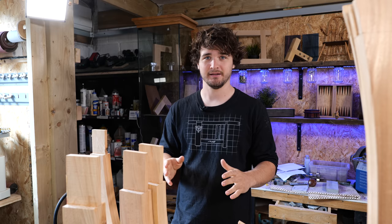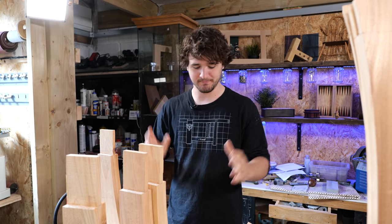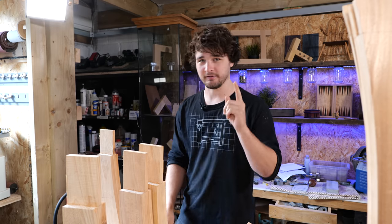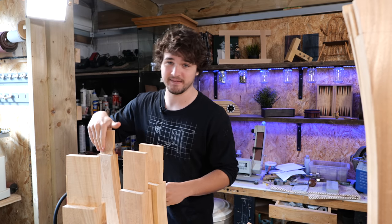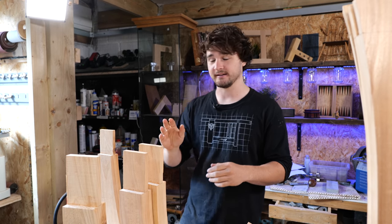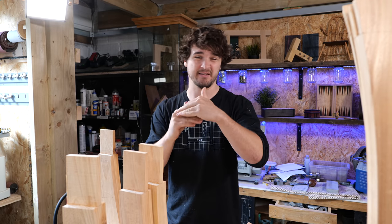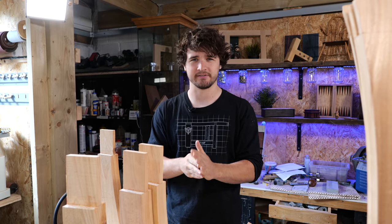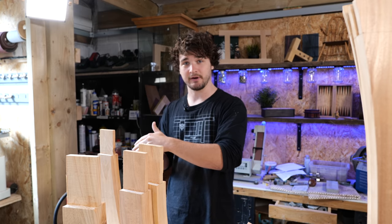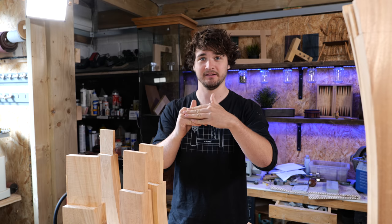And what's annoying is I knew about these concepts, but in the excitement of cutting out these joints and making this bench, I just completely forgot about them and started hacking into it with the chisel. The two suggestions were, firstly, soak the end grain with denatured alcohol to soften it, then that makes it a lot easier to pare. Secondly, lower the angle of the chisel to 17 degrees, which was the most common suggestion. I think it's something Rob Cosman suggested, not entirely sure, but soaking the end grain with denatured alcohol and lowering the chisel angle would have made this process so much easier,